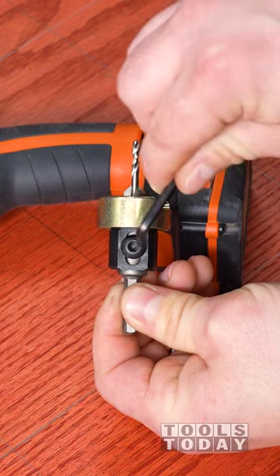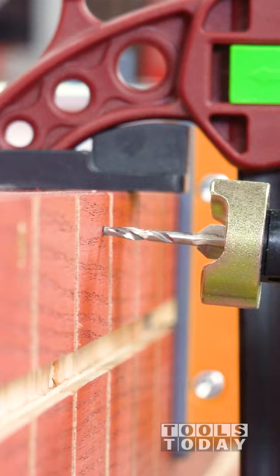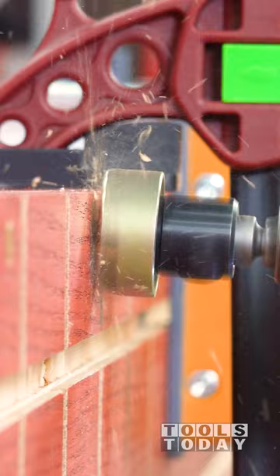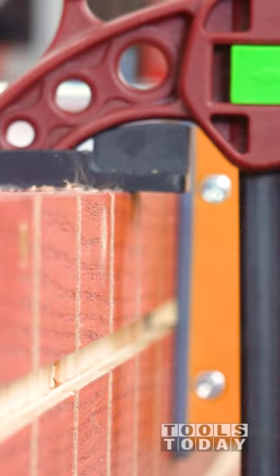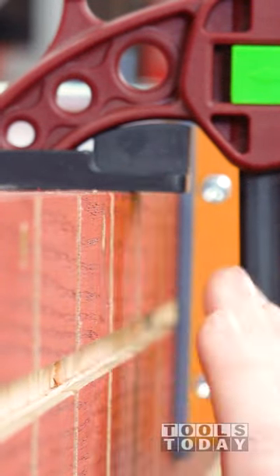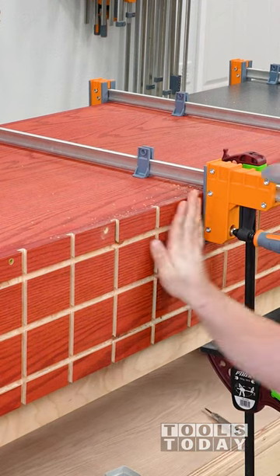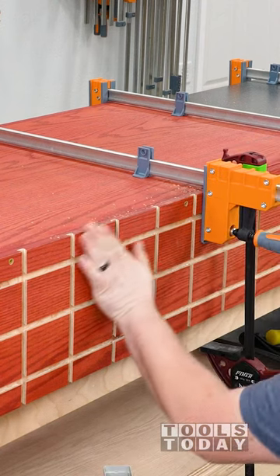It's time to install the remaining pieces on this match fit work holding top for my workbench. This is the 55227 adjustable depth no-mar countersink bit. It does a great job on any of the countersinks — this is my go-to bit in the shop when assembling things. You can adjust the depth perfectly to match the depth of your screws and get a nice flush fit.